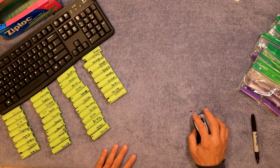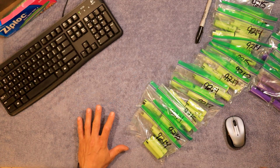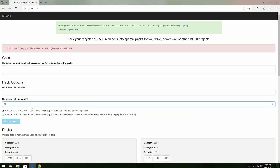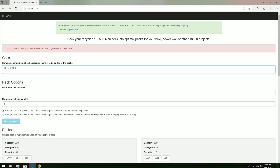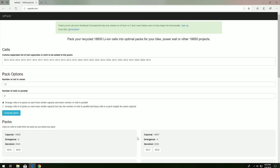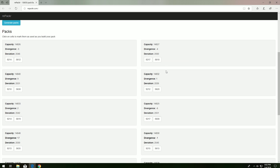Let's generate the pack — these should be a lot tighter. The divergence is minus 2, minus 1, minus 1. Everything looks good. Now I've got all the green ones bagged up and all the purple ones bagged up. I'm going to treat each bag as a cell, so that means I have two cells in parallel — one purple, one green — and still 13 in series. Going to do the same thing over again, entering the bag totals.